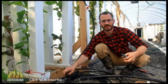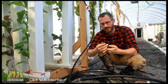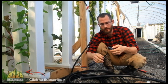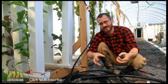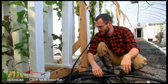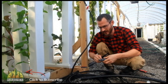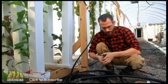For poly tubing we primarily use barbed fittings — it's pretty self-explanatory. The barbed fitting fits right into the end of the pipe. You might need a hair dryer or heat gun to heat up the plastic and squish it on, but once it's on it's going to stay. Unless you live in a really hot place you probably don't need hose clamps, but because it gets hot here and the sun is bright, we put on either crimp-type hose clamps or stainless steel bolt-type hose clamps.